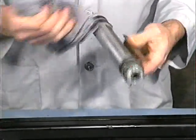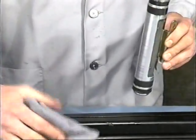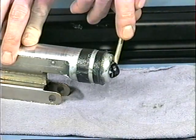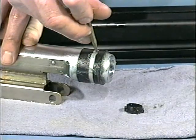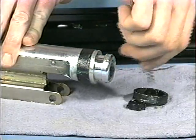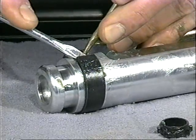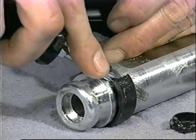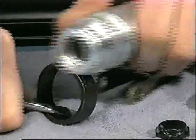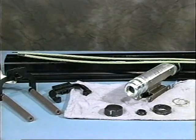Wipe excess grease from the piston. Remove the cushion seals from the ends of the piston. Then remove the U-cups and the wear rings. Use care when removing to prevent any damage to the grooves. There are no wear rings on the 1-inch bore model. The BC2 Band Cylinder is now completely disassembled.